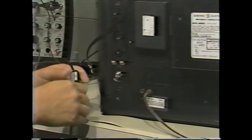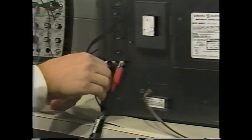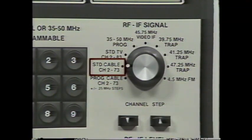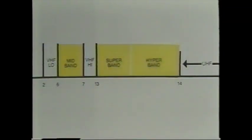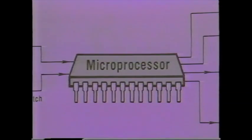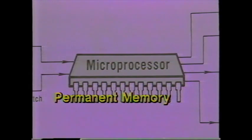Remember to move the RF cable to the correct antenna input when the TV or VCR has two connectors. In the standard cable mode, channels 14 through 73 produce cable frequencies, and the generator automatically switches among the three cable bands — mid-band, superband, or hyperband — as you change channels. The VA62 stores programmed shifts into permanent memory, so you don't have to supply 24-hour power or reprogram the channels each time you turn on the power.